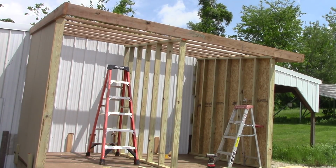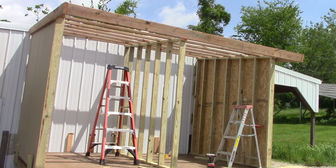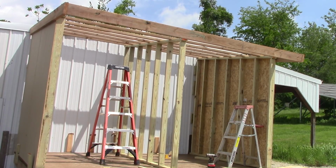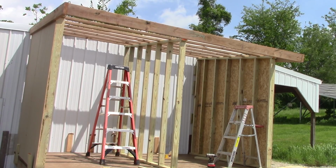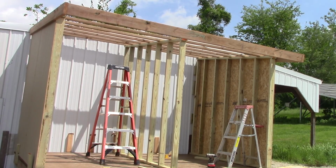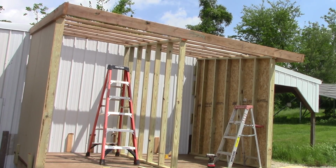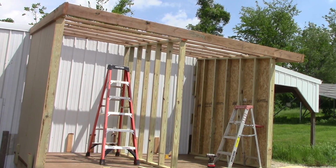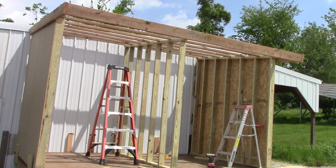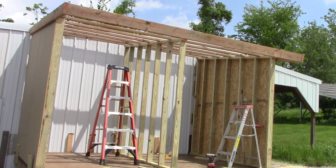I have to take my braces down, and I can start on the front walls. So progress, progress. That middle wall there is actually going to be my wet wall. The shower will come out of it on each side at the back area there, and then just up from that, probably 1, 2, 3, 4 cavities out, there'll be a deep sink on each side, and a little sink there so people can wash up stuff,